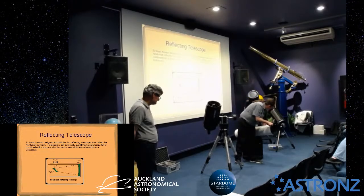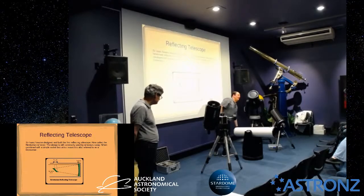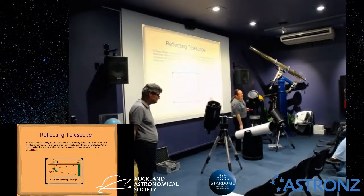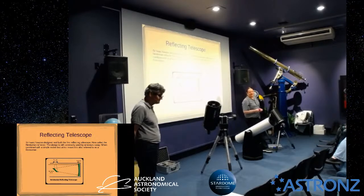So that's roughly on. I'm not taking too much time, you see it's roughly going back to the spot there. But if it wasn't, then the other thing you adjust is the primary mirror. So if I can, you should see that moving around now. So it actually takes less than 5 minutes to collimate a Newtonian. So if you've got a Newtonian and anybody's scared you by saying, oh, don't touch those screws, just put up with it, it's too scary to collimate, it's not, it's easy.